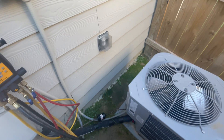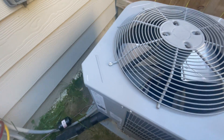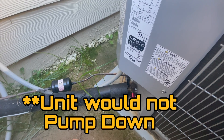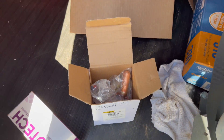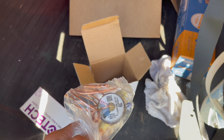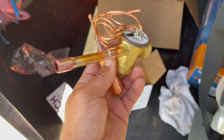All right, so here we are. We're going to be pumping this unit down. I usually like to replace the refrigerant whenever we do a TXV, but in this case we're just going to pump it down. I'm going to show you the TXV and how these Carrier ones are a little different. We usually primarily do Trane or Rheem — that's what we deal with the most — but every now and then you get a Carrier one, and you've got to be super careful with these things.